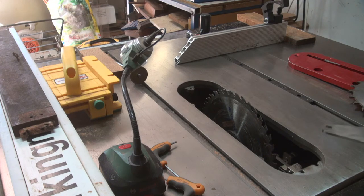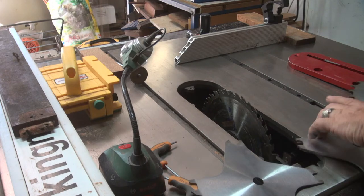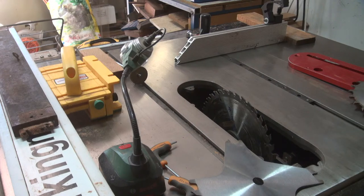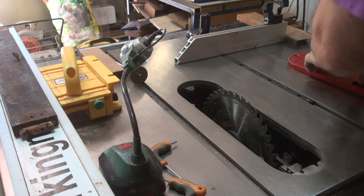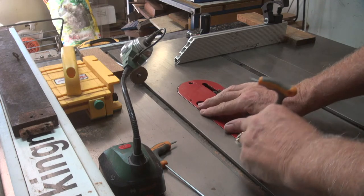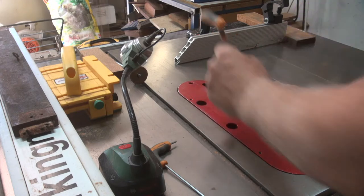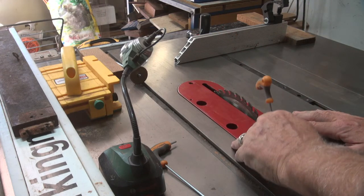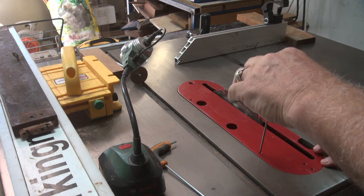I've got three sizes, but these are 3 mil. That's a 3 mil. That's a 2.2 mil. That's a 3. That's a 3. And the support blades are 3 as well. And then I think I've got a 1.5 as well. So you can get up to 21, 22 mil. You can't really go much larger. If you do, you run out of spindle on the motor. Whoops, what's going on here? This looks good. It's got me beat how these things go out of whack, but you gotta pretty much tune them every time you put them in.